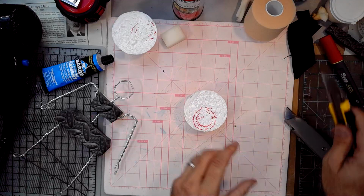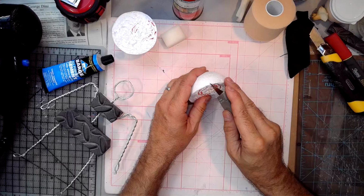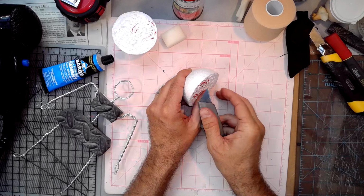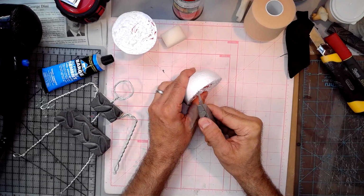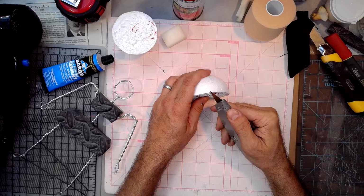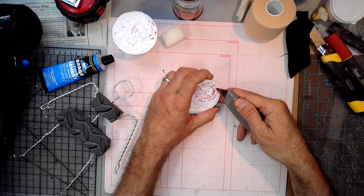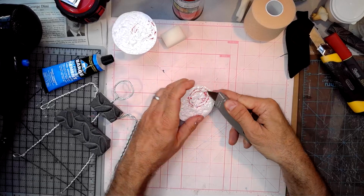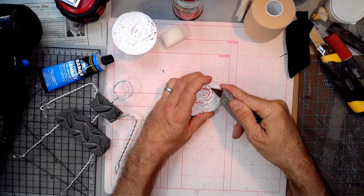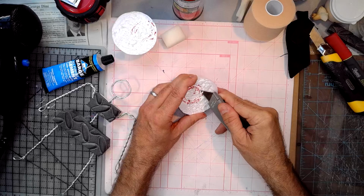All right, knife here. So a little V groove should be enough. Cut a little V in to start, and again it's going to crush the foam if you don't saw sometimes. So you just have to go slow and wiggle it a little. A little bit of sawing action should be enough to prevent it from just crushing the foam in. And go all the way around the V. And yeah, crushing it a little bit's not going to hurt.